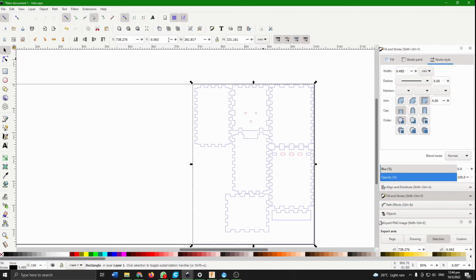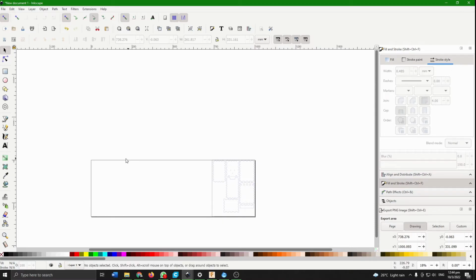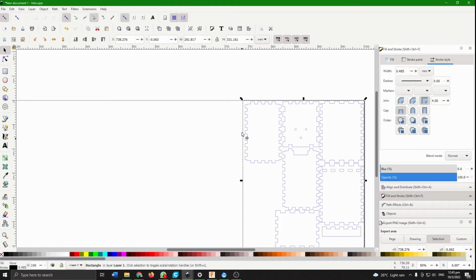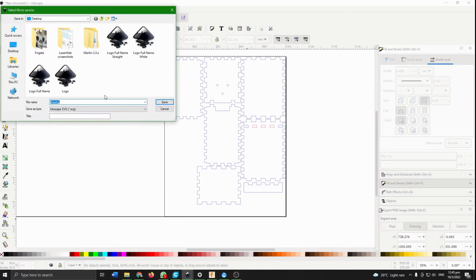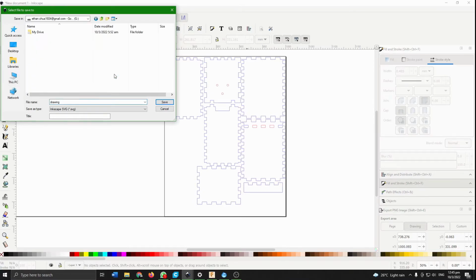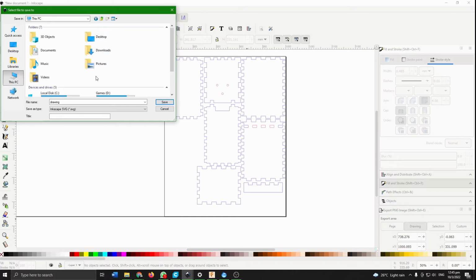and now when I click on this and I look at the dimensions, I can see that the width is 261, which is about 26 cm, and 331, about there. So when I cut my piece of stock, because clearly this whole thing isn't gonna go into a laser cutter, I know I must cut it to a length of about 26 centimeters, so that's what I have to remember. Alright, so now I'll just save this, putting it under... wrong. Where is it?